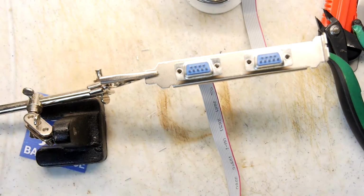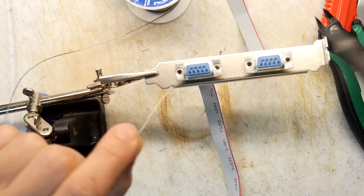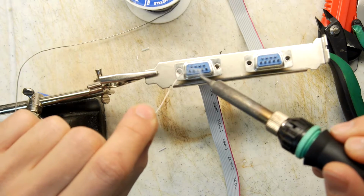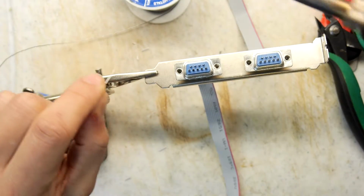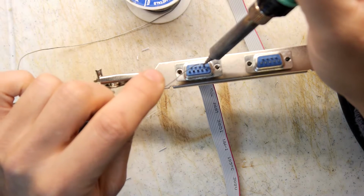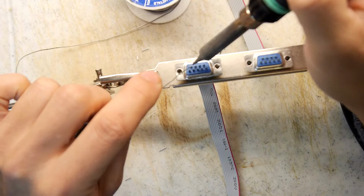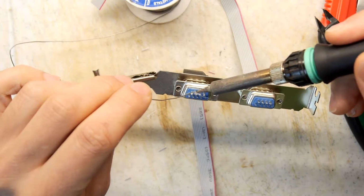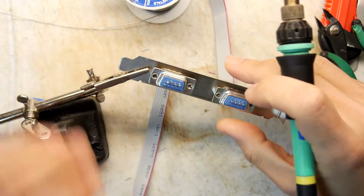Wow. Who'd have thought it? They're all actually wired sequentially. So the red is pin 1. I'm blown away by that. That's going to save a lot of time. I don't know why I assumed it would be any other way, but I think I did assume it because sometimes you'll have pin 1, 2, done this way because mechanically that's easier to do. But some poor guy in the Far East somewhere has had to sit down and make sure these are all soldered in sequentially for us. Good. That's the sign of a good job.